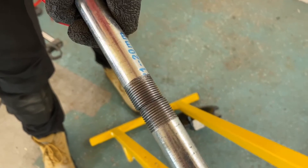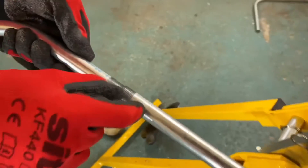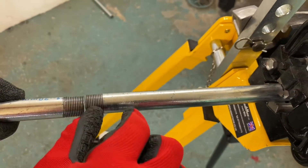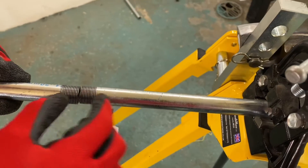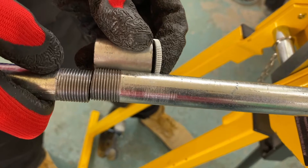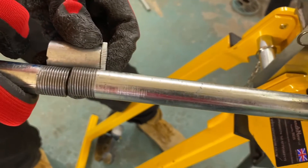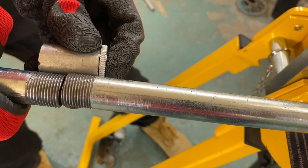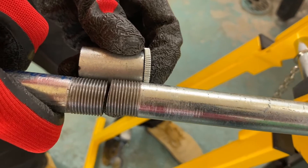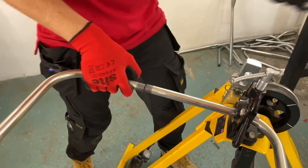Those two pieces meet up, but we now need to do a running coupler on this side, so we need to thread the length of a lock nut and a coupler. We can have them both sat back here so they'll be flush with this piece of conduit and then they'll twist on. You'll spin it on as we've just done but then you'll wind that coupler on to lock it off — and that's called a running coupler. Let's see you get busy with the threader then.